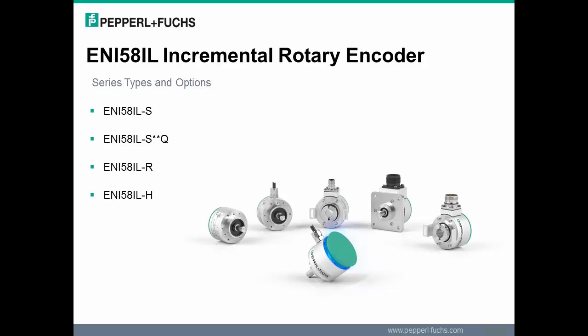All of these options have an IP67 rating with a negative 40 to 85 degrees Celsius temperature range. The advantages of the through bore hollow shaft encoder are that it can be mounted on end of shaft or between other components, adding flexibility to adapt it to any application. The recessed hollow shaft and hollow shaft both have very easy mounting — a clamping collar attaches to the shaft and you secure the torque rest mount to keep the hollow shaft encoder from moving radially.